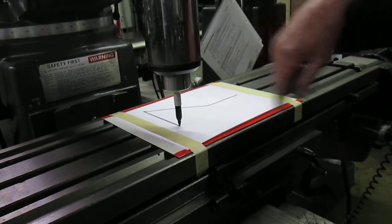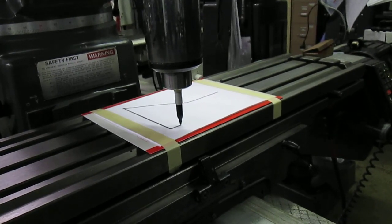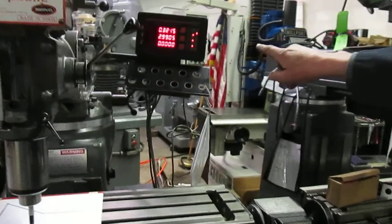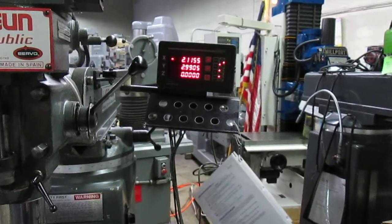This is more fun if the pin wobbles. We'll take a look at the DRO while I'm showing this, so they can see it change the position. The DRO tracks you all the way. The control actually reads its positioning from the digital readout, not from the motors or screws.